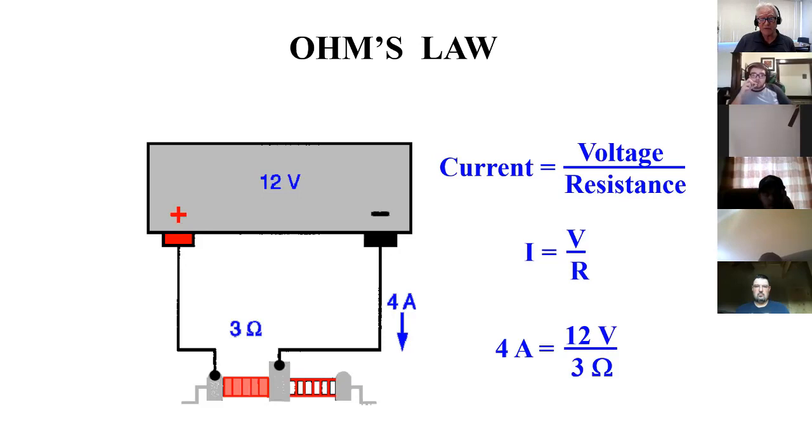You know, so usually you're going to see the voltage say nothing or 2 volts when it's supposed to be 9. Now you've got a problem. But again, a lot of times you just need to be in a ballpark with stuff. So don't ever approach a problem in too much detail. Don't get into that thing where you can't see the forest for the trees before you start digging into a lot of prints and really doing the heavy head work. Again, step back and make sure nobody kicked off a piece of conduit or a fork truck didn't knock something off, a limit switch or something, that's causing something not to work. But sometimes you do need to calculate numbers, and that's what Ohm's law is good for.